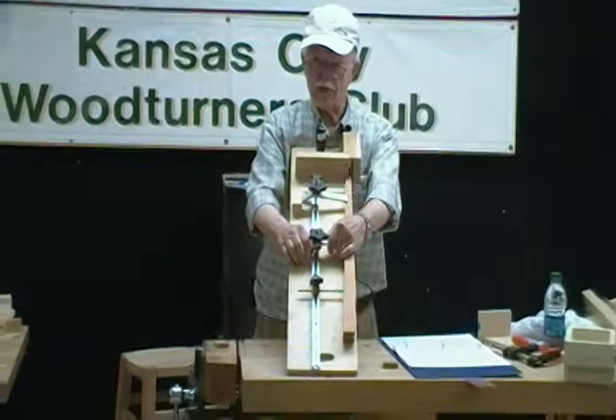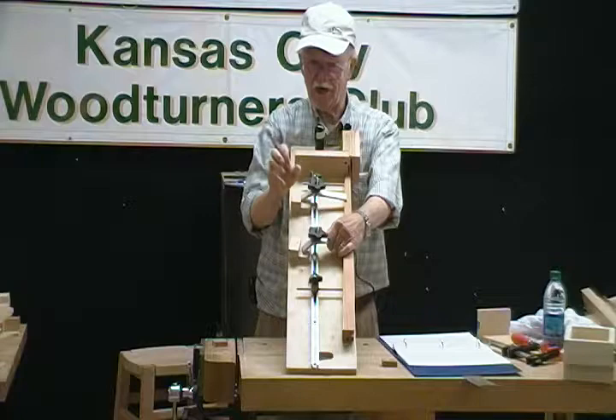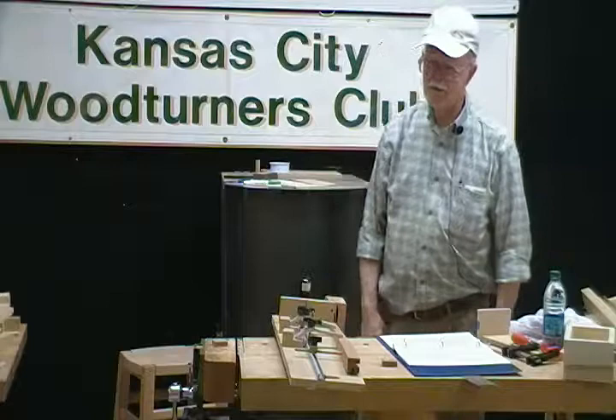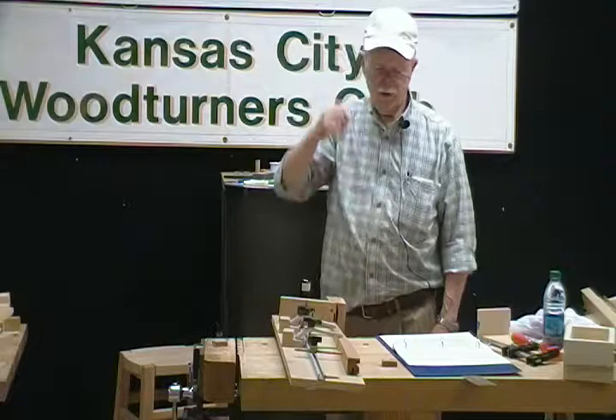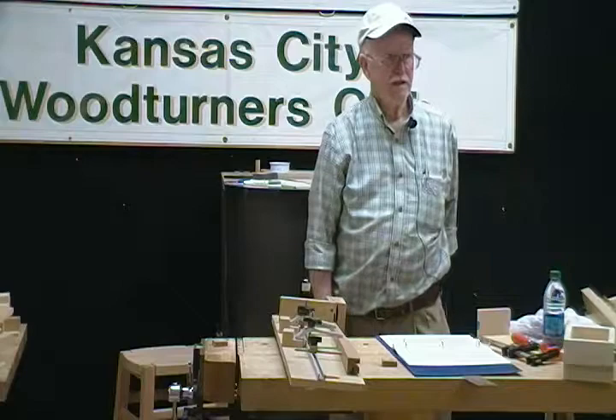While I'm on this soapbox, I'll talk about the locking knobs on the table saw. When you tighten stuff down, you only need a quarter of a turn. You don't have to bring Tarzan back in here to undo it next time you want to adjust it. When you tighten locking knobs, clamping knobs, or any type of knob, do not gorilla-tighten them. It's unnecessary, you wear them out, and you make the person who follows you on the machine very put out with you.